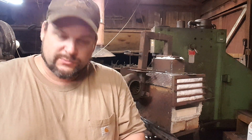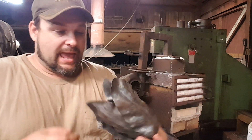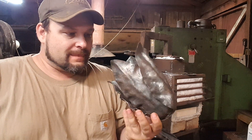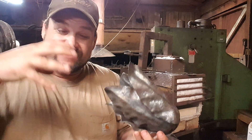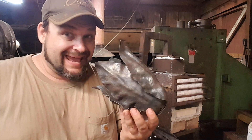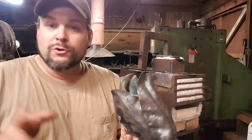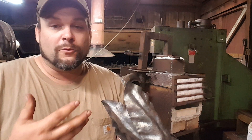Earlier we were doing some lighter stuff — there's the leaf project. This was one of the pieces we were testing for a pendant light. The problem I was having is that there was too much gap in between the leaves. In order to mold this down I needed a form, but even that — this is 14 gauge steel — is very difficult to move cold. I put this on a stick and crammed it in there, and I can form this hot, whatever I need. Problem solved.